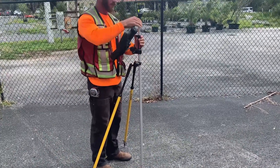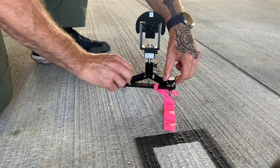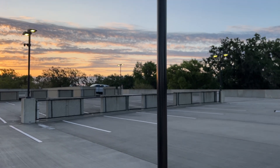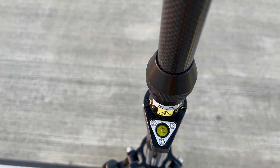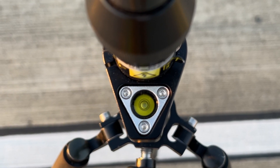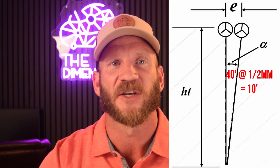Because your height of target goes from about 1.5 meters or 5 feet to around 20 centimeters or two-thirds of a foot, there is a huge drop in pole plumbness error. Pole plumbness error can be thought of as how accurately you're leveling your pole or tribrack over the point you're set up on, and is a function of height of target and bubble sensitivity of your pole's level bubble. Let's look at three examples. A typical carbon fiber topo pole has a 40-minute bubble, which means the pole will be leaning 40 minutes out of plumb when the bubble moves 2 millimeters off center. We should be able to keep the bubble centered better than 2 millimeters though — let's assume half a millimeter is about typical.